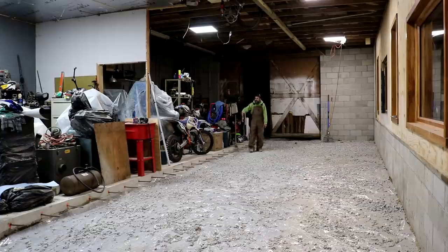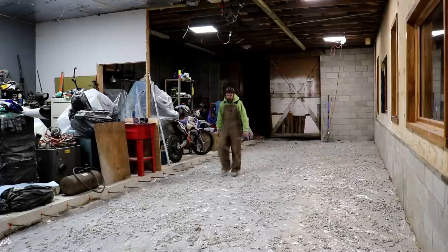So that's the plan, is to put a piece of sheet metal that's at the height of the pad, all the way down the shop, good and level, at least from the middle of the shop up, a piece of sheet metal to screed to. That way this side's good and flat, good and level, and I can address this side with a skim coat maybe in the future. I don't know, give me your suggestions because I can use them, but I think that's what I can do to address this, end up with a good section of pad, and then worry about their crappy work later.